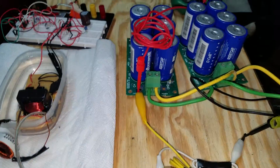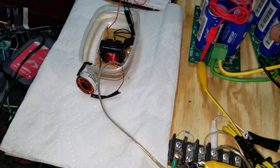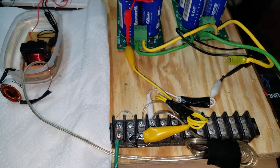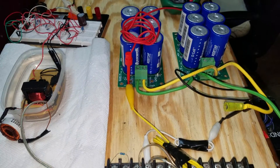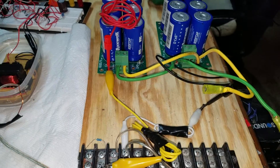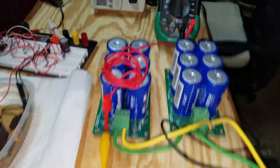I've figured what I'm going to do — we had a request to add a normal charger to see what kind of wattage is going to be used for a normal charger to charge these caps. Unfortunately, the caps are almost charged to begin with; they charge up to about 16.2, 16.5 volts. I try not to get them up that high because it damages them. You get a lot more cycles if you charge them to 14.5–15 volts. So I'm at the upper part of the range. I just connected these in parallel to test and see if there was any additional load on the source to charge a second 60-farad bank in parallel, which makes this 120 farads.